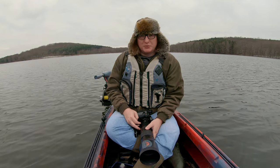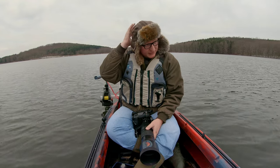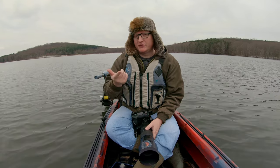If you're going to go through weeds, make sure you have the motor on one of the higher speed settings. That way you can just push through it, because it will build up on the front of the motor, on the trolling motor mast. And the grass ninja works really good. Nothing was stuck to the prop itself. Nothing got inside there, so that was pretty nice.